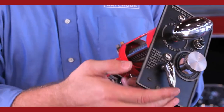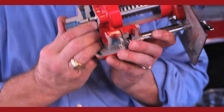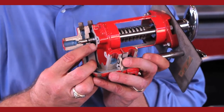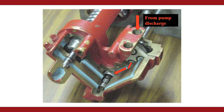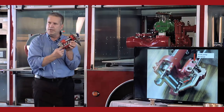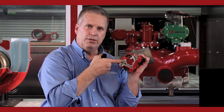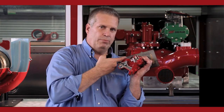The on position, we have the valve set. Again, it's going to take a certain amount of water pressure to overcome the spring pressure to push the needle valve off its seat. So right now we're operating the valve. We haven't had a spike in the system. Our discharge valves are operating. So the water flow comes in through the four-way valve. But now, rather than letting it go to the back of the relief valve, we're going to route it over to the strainer. Through the cross hole, there's a flat surface here on the needle valve. It's pushing on that surface, trying to overcome spring pressure.